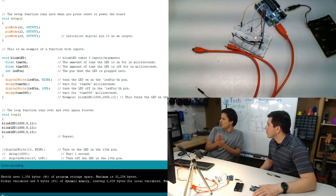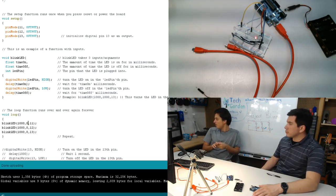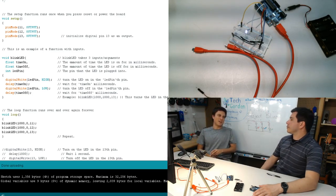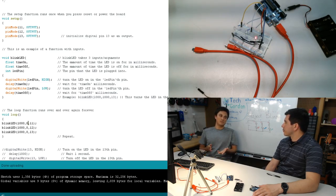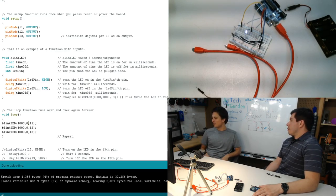Oh, very good. Yeah, Science Family, you should definitely let us know. Oh, they did. It's right above it. Yeah, sorry. Nice. These digital inputs, delay, digital write. Oh, yes, that's exactly right. So they did the exact same thing that we did. Awesome. Except I told the microcontroller to wait 0 seconds. Right, they just told it not to wait. Well, yes, that works as well.